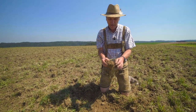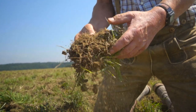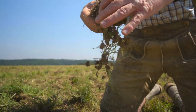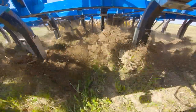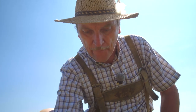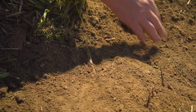As you can see here, we dug quite shallow — two to three centimeters deep. The grass clover is completely separated from the root and laid on top of the soil. The wind and the sun dry the grass clover. In organic farming, this replaces the use of herbicides. Everything has been cut cleanly over the entire surface. With our cultivator, the sweeps overlap by eight centimeters, resulting in a 100% full surface cut. Another crucial aspect is that the earthworm pores in the soil remain open — they must not be smeared over. In the event of heavy rainfall, the water must be able to pass through the pores. Nothing is smeared and the grass clover was cut cleanly, covering the whole area.